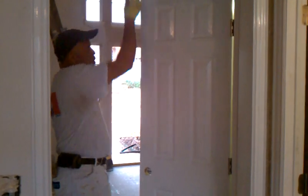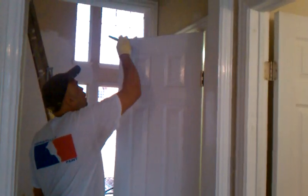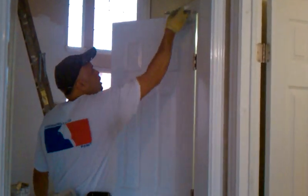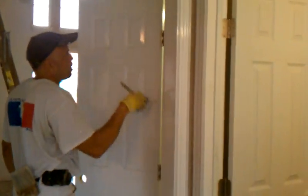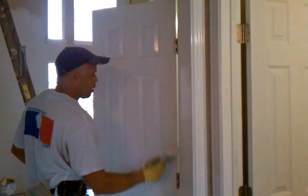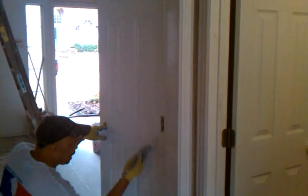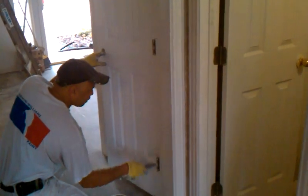See how I'm doing it? I brushed this one side out. Now I'm going to go across the top. These are just tips you can use for your oil-based paint — these are the steps we do with Clark's Painting. We're going to paint the hinges because throughout the rest of the house the hinges are painted. Normally we don't paint them unless the rest of the doors are painted. These are just steps we take when doing oil-based paint.